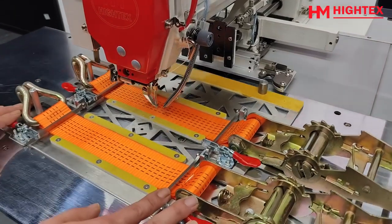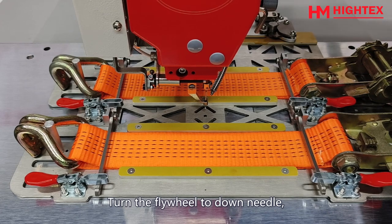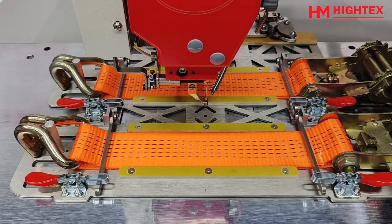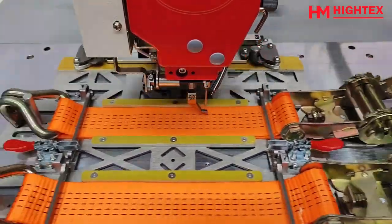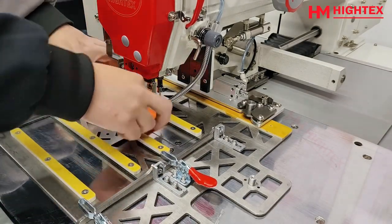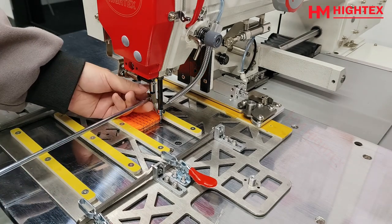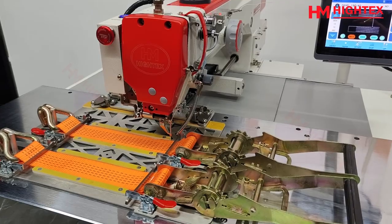Put the pre-install clamp in place. Press the right pedal to lock the quick change clamp. Press the origin point key, then turn the flywheel to lower the needle. Make sure that the needle aims at the origin hole. Perform trial sewing as in the previous Step 4. Adjust the height of the intermittent presser foot as in the previous Step 5. After finishing the adjustment, you can start the sewing production.